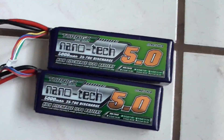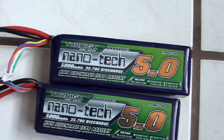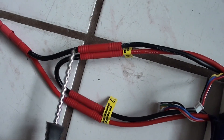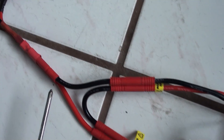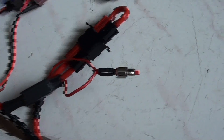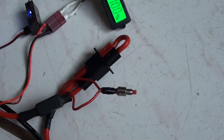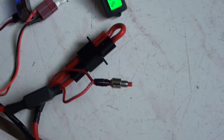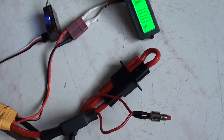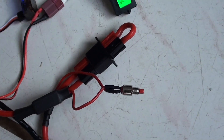I got all my electronics together. These are my batteries — these are five cells each, a total of ten cells. I wired them in series with this series connector. Then that connects to a high current arming switch. When you go to make all your connections, you want that pulled out, because it prevents spark from occurring anywhere in the system, which could actually short out or burn out a motor. So you definitely want some kind of arming switch.